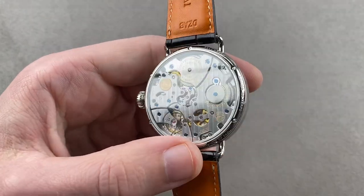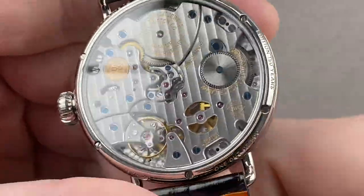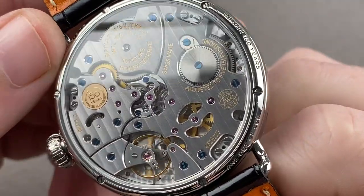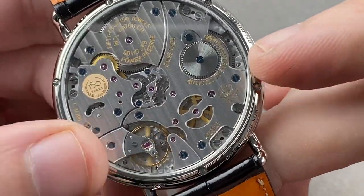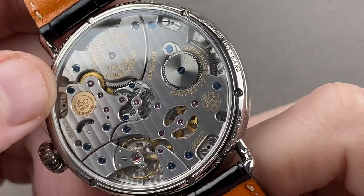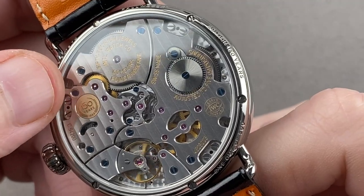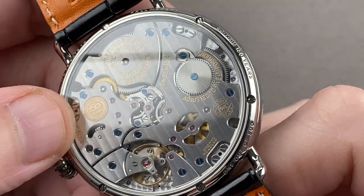This movement was built just for this watch. Well, it's clearly based in some regards on the 52000 series movements. It is unique. This is caliber 94200, and what I like to shout out is that there are really two drivetrains. There are two mainspring barrels. It has a 60-hour power reserve. Remember, the original Zeitwerk, right up until 2019, had only a 36-hour power reserve, so this is genuinely impressive considering it has the same type of display.